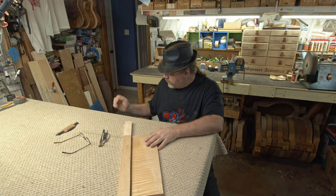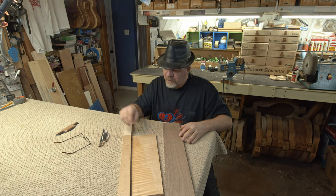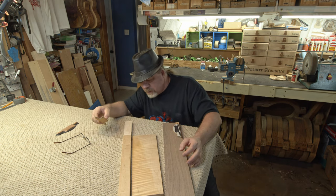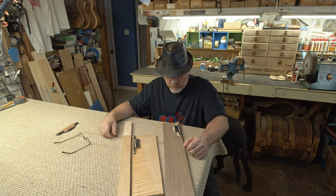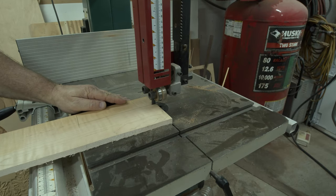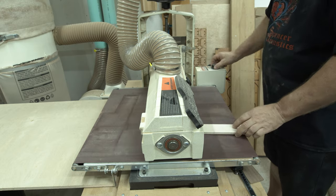For the bottom I also found another piece of walnut in my scrap pile with some nice straight grain on this end. I'll use right about here for the bottom and right about there for the top. I started by making layout lines to follow at the bandsaw, then cut the pieces to length and width, and finished them off by cutting them to rough thickness.